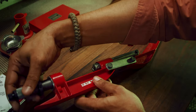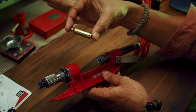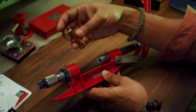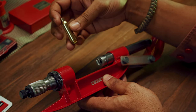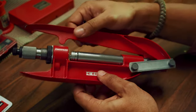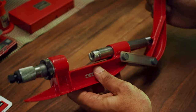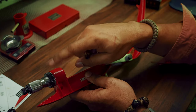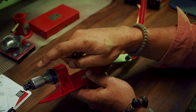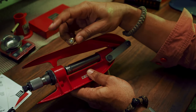I find the press is great for short cases. This is a rifle case, short action, but I think this press works best on pistol calibers. With longer cartridges it's very difficult to operate and there's not a lot of grip — the metal is very thin and it actually hurts your fingers. So what I've decided to do is use the neck sizing die pulled up as far as I could with the decapping pin extended as far as possible, just to deprime the cases.